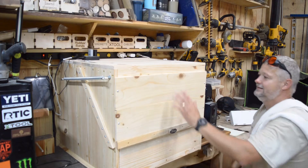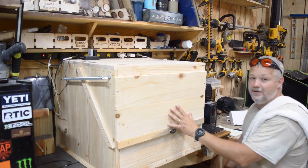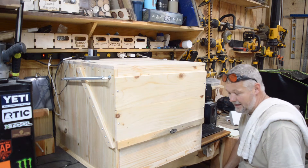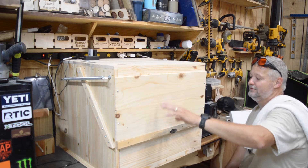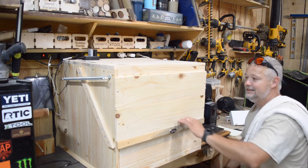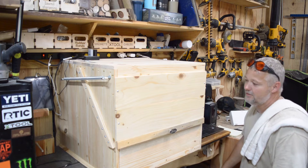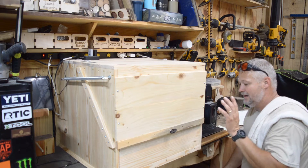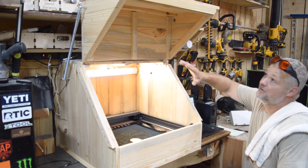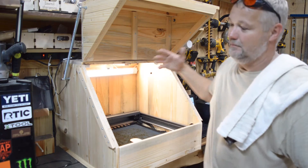Right now I've got wood on the front — just these two little 3 and 1/8 inch pieces of cypress — just to cover up that hole so that I have some eye protection until my glass gets here. I have ordered the orange plexiglass, and when it gets here I'll engineer a way to attach a piece to the front. It will be open from here to here and have a window. The pieces I got are 24 inches wide and 16 inches tall, so I'm thinking I'll be able to make a pretty sizable window. I wanted to make sure my hinges, closure system, and holdback were going to be adequate, so I added a bit of weight with that wood. The plexiglass will actually weigh less, so the closure action will work.